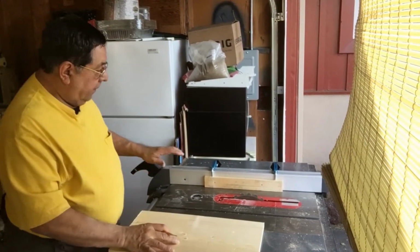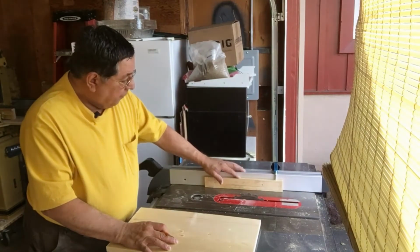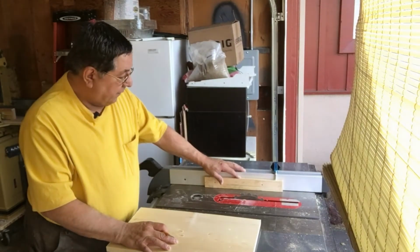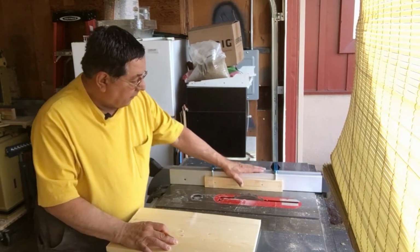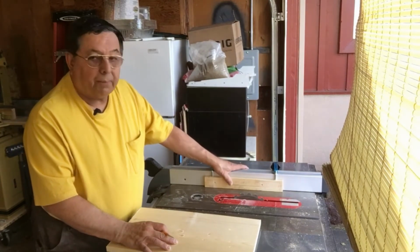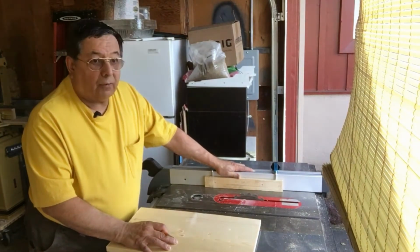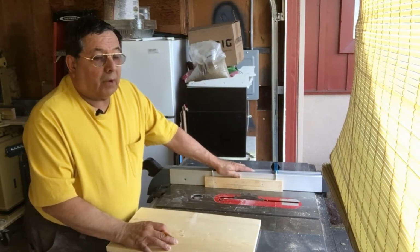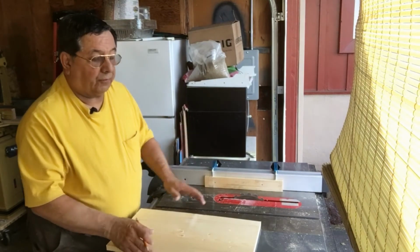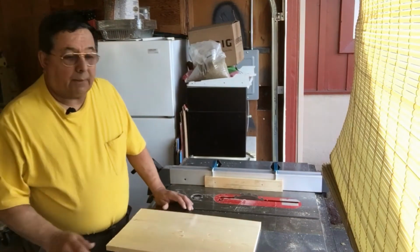On the table saw, I have this scrap piece of wood here, which actually was my story pole, but it's no big deal. And these are Rockler accessories that you drill a hole in the wood, and it helps you put a piece of scrap on the fence. It's really a good idea. Plus, I like always backing up my blades when I'm burying something like that in wood, especially when I'm working on a shaper. I'll use a lot of MDF in that capacity.